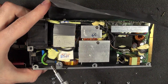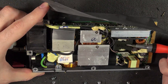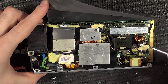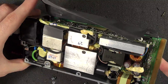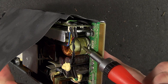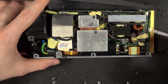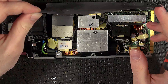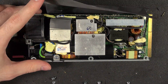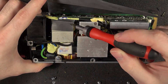Good grounding clip, and then it just gets buried. You can see this giant filter cap here, what looks like a transformer, then a choke, more big caps. There's a very tall stack of inductors here — two magnetic cores with copper turns around them. These heat sinks come up through it. You don't need to worry about getting heat to the casing because you're blowing air through everything. These tiny little connectors connect the fan.